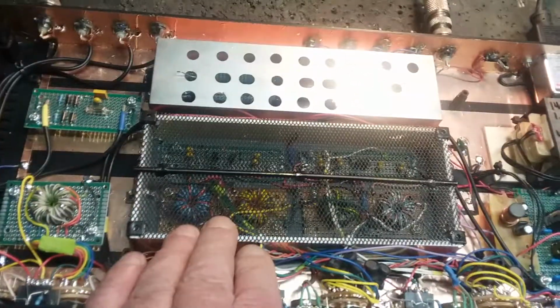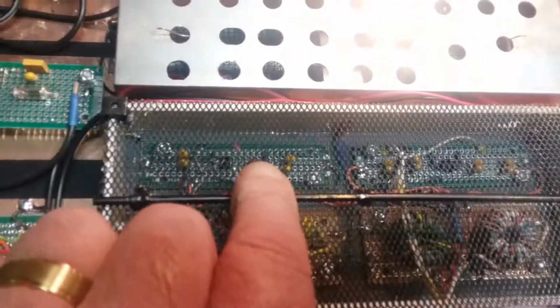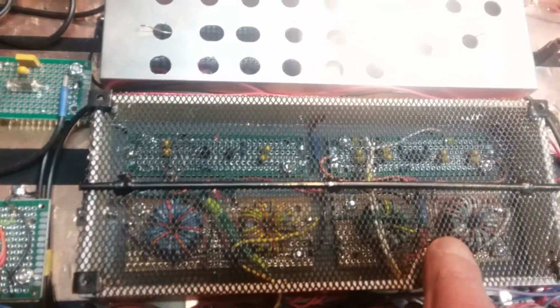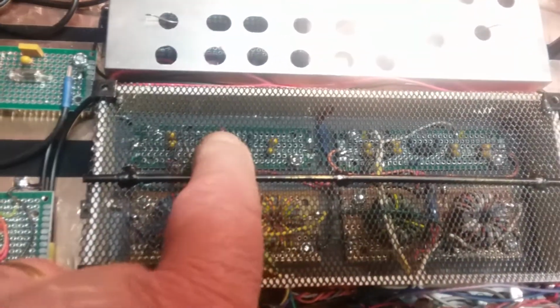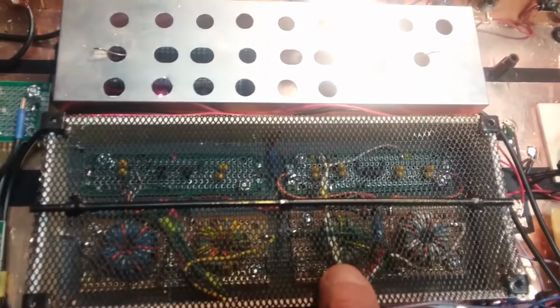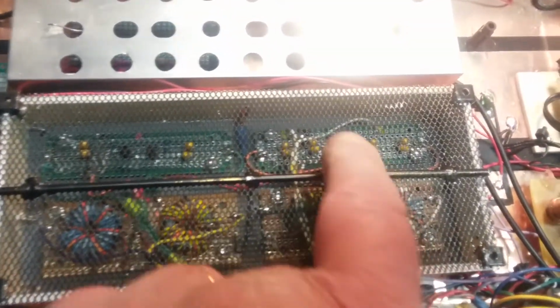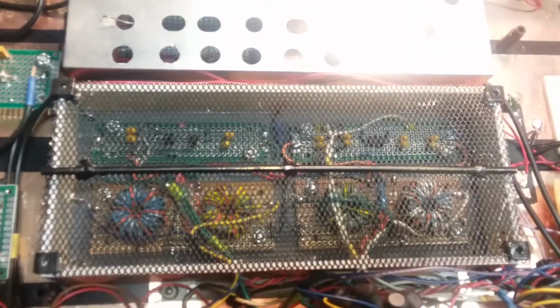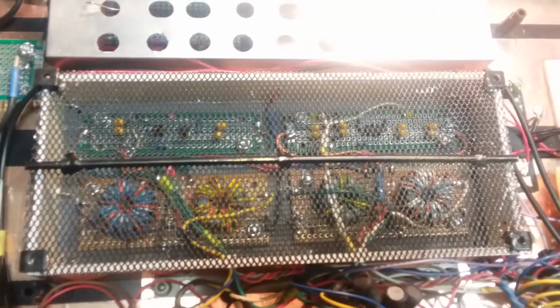If you looked at the other videos, here's the peak and the notch circuitry, along with the varactor capacitors working against the coils, where we established very low impedance for these varactors to work in the peaking circuit, series resonance, LC, and very, very high impedance here for the parallel LC to work in. There's curves and graphs in there. You can see why we do low impedance for series resonance and high impedance for parallel resonance.